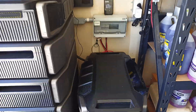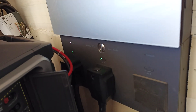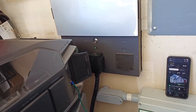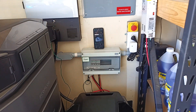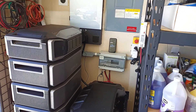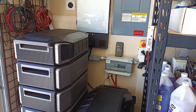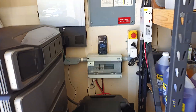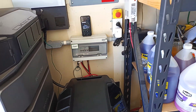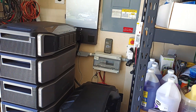That completely goes away when you add the second DPU into the smart home panel. So if you're going to run the house, I would absolutely recommend doing two DPUs just for stability. Sometimes power meters will show like a brownout, where the power just dips quickly in voltage, which could be harmful to appliances. That's why I personally put UPSs on different devices — especially things with compressors, refrigerators, freezers, and my electronic equipment.